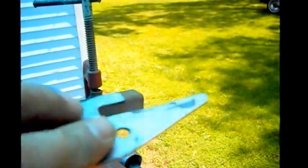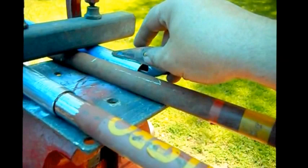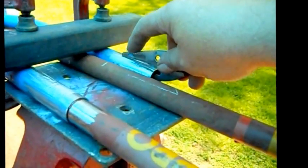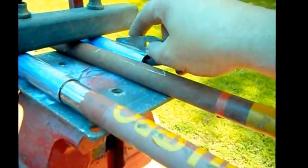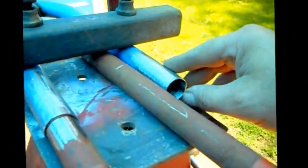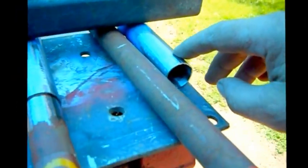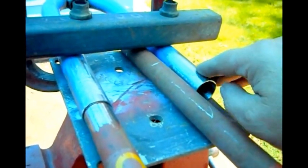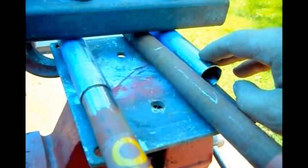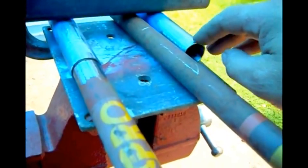This is how I make my forks. I cut these off and clean them up, which is not easy to do. You have to take a cutter blade down in here on the welds, go very lightly. You can rock and break them off. I'll take a flapper disc and clean it up so you really can't tell where they were welded. You have to do that very carefully. I have ruined a set of forks to get a good set, so I take these off real carefully.